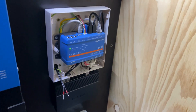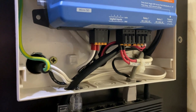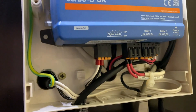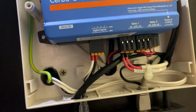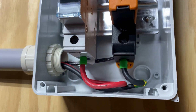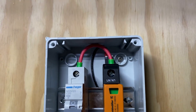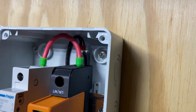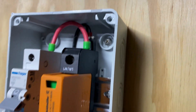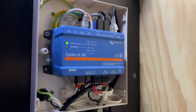Then we'll go inside and set up that input on the PC. The wiring is all complete. Digital input 2 — both wires pushed into the block now. The grounding wire, the active wire — that's protected by the 20 amp circuit breaker. Up the top there are the contacts of the SPD. We'll put the cover back on now. All the wiring is complete.